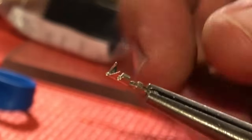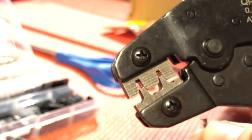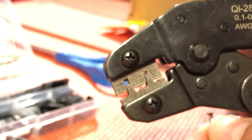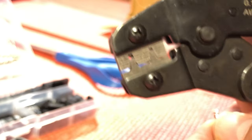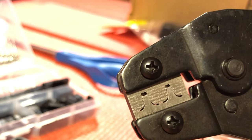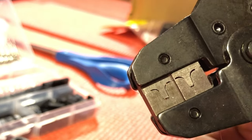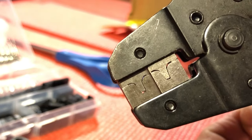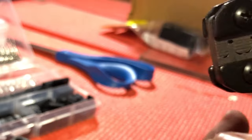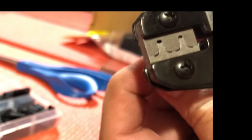When you set this thing into your crimp tool, the way it works is: one click it will stay, two clicks it'll stay, three clicks it'll stay. If you squeeze it all the way in, you'll notice there's still a gap on one side. But if you flip it over, you see no gap — or a much smaller gap — versus the gap on the preset side. That's how you know the bigger flap needs to be on the side with the larger gap.